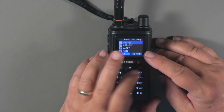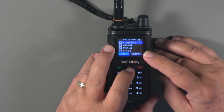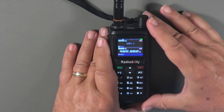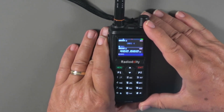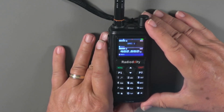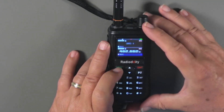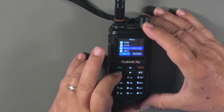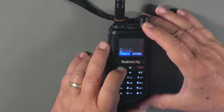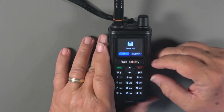I'm going to select beginning of transmission. Then we want to go to ANI Edit. The ANI Edit allows us to edit the number that the radio recognizes for its ANI code. You can set that in the CPS, but if you're gathering with friends all using this radio, you may have duplicates, so this is where you make an edit. So here's ANI Edit — I can just type it in. If I wanted 103, I'd enter it and hit OK. Now my radio is code 103.